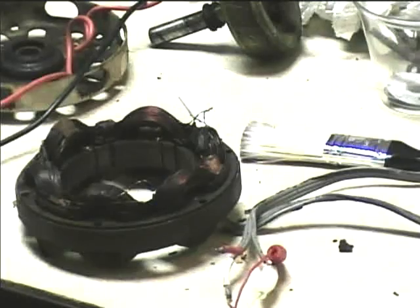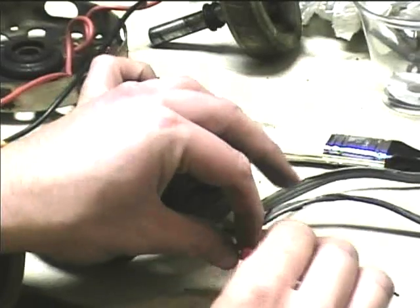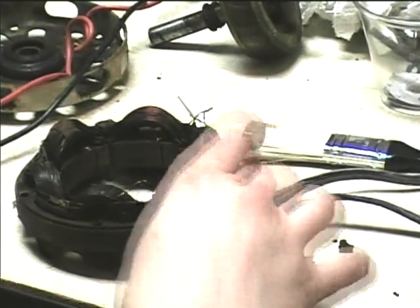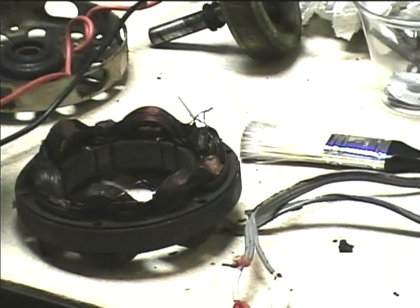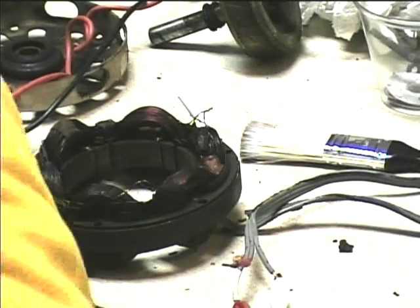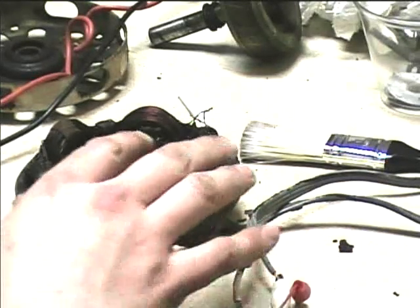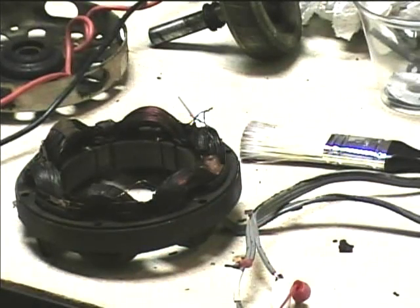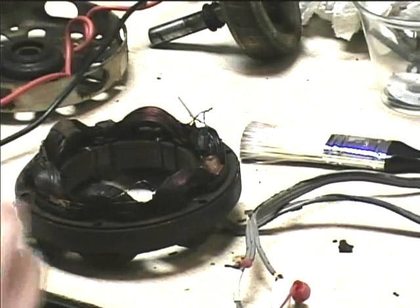I think I've now found the problem. I've restored this connection where the wire broke and now I'm getting continuity from the neutral to the hot side of the line — not a short, but reading about 14 ohms through the entire winding system. I'm going to solder this connection now and use some heat shrink tubing to insulate these connections.